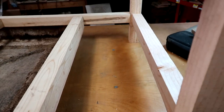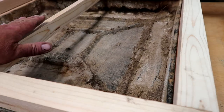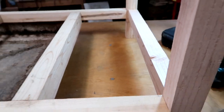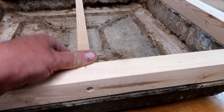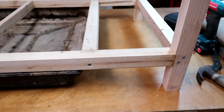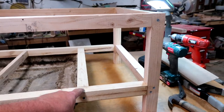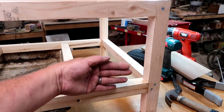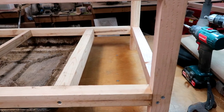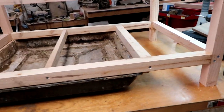This area over here will be their sandbox area, so I'll put a piece of plywood under here. There'll be hardware cloth coming across here, and they hop down into the sand and play around — or there'll be a separate container for sand. I did put this three-quarter-inch piece just to hold the hardware cloth, so that's at about 12 inches. I'm also going to put a vertical support and about four inches of plywood on the sides — three sides — because quail like to mess around with the sand and shake it everywhere. If it's in a garage or indoors, it's just going to go all over the floor. So that's just a little protector — they'll still be able to look out, it'll just help control the sand.